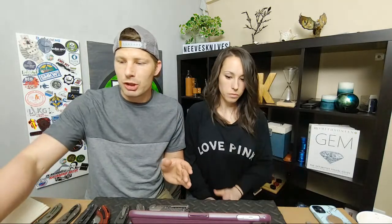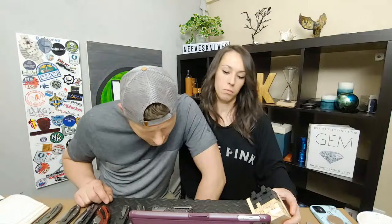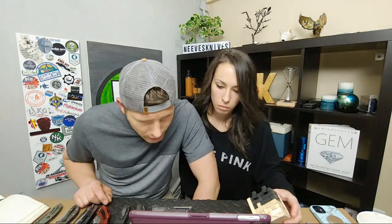The hardest and worst knife I ever sharpened was the ZT in S35VN — the 0450. I don't know what they did, but the heat treat was off. Some parts of the edge were hard and other parts were soft, so as I'm sharpening it some parts would sharpen while others wouldn't — just crumbly, almost like chalk. It would get sharp and then go dull, get sharp and go dull. I've taken so much steel off of it, and I've sharpened hundreds of S35VN knives.